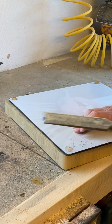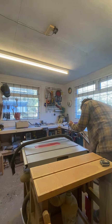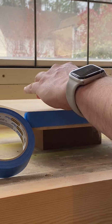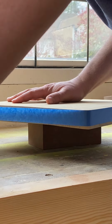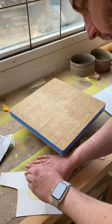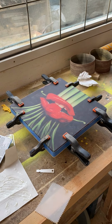I popped the remaining 3 feet off the glass board, then tried to relieve the workshop of as much stray dust as possible. Then gave it a clean with some acetone, before masking off the edges ready to glue the glass on the top. I wasn't really sure how much the masking tape was going to help me when I epoxied the glass onto the worst face of my Iroko board, but I left it to dry for another day